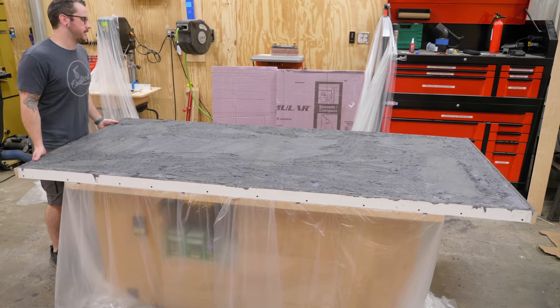After polishing, I left the top to dry out and continue curing for a few days, then it was time to seal it. I used another Fishtone product: their U-Seal Concrete Sealer, a two-part mix that you dilute for the first few coats to help it soak into the concrete more readily. I rolled on the first coat of U-Seal starting on the edges — you can see how quickly the concrete soaked this stuff up. On that first coat I left some puddles in spots, which I'd really try to avoid since some of those areas soaked in before I could get to them and are still darker than the other areas even after all three coats. After applying each coat I dry-rolled the surface to remove any excess sealer, which can cause mottling and unevenness in color. It's crazy watching back this footage how much the top was still absorbing on that last coat — this concrete was very thirsty.